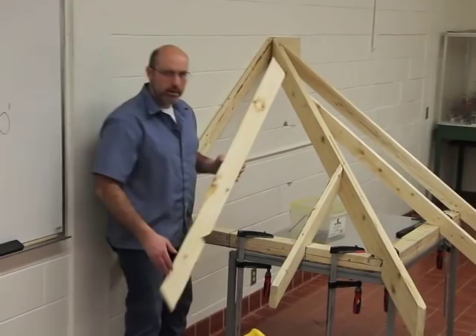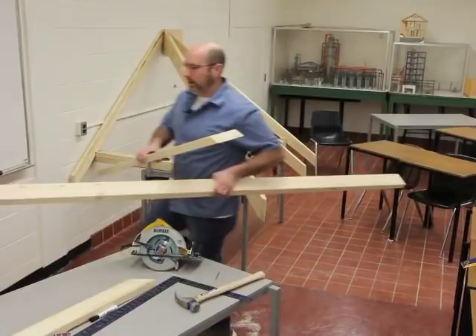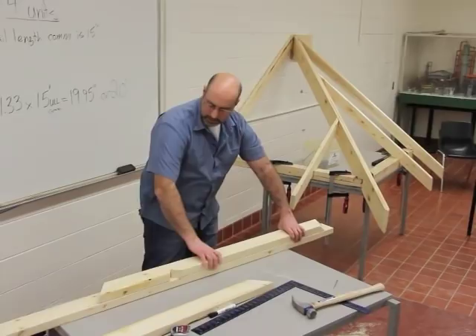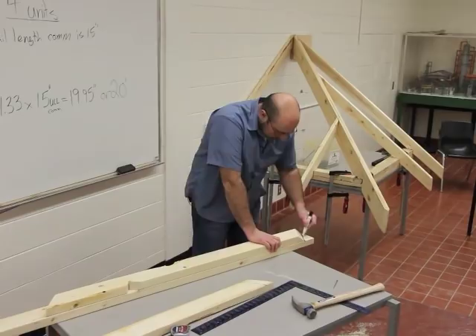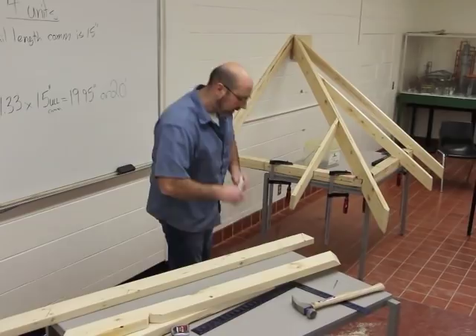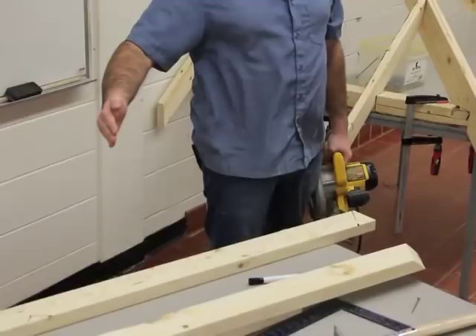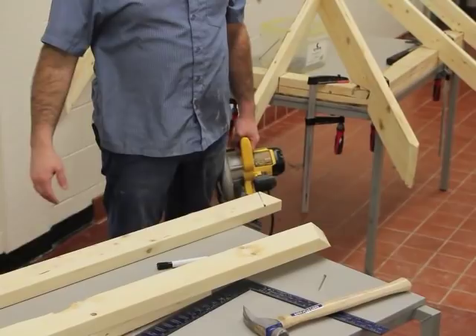Here's a little trick: Travis has already got the opposite side cut, but if you didn't, rather than going through the bother of doing the layout again, place your jack rafter on top of your blank stock, trace from your long point, trace out your bird's mouth and your rafter tail, and you can duplicate the opposite jack. By doing that we'll cut the bevel, cut the bird's mouth, cut the end, and have the opposite side. That is jack rafter layout, difference in jack rafter lengths, and cutting your jacks — single bevel cut is best.